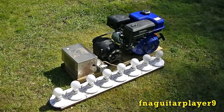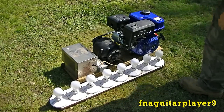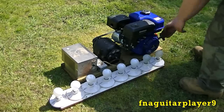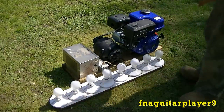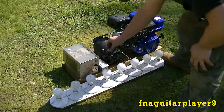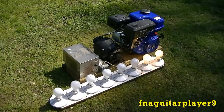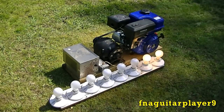Now I'm going to start it up under load, and you're going to see the bulb won't come on. I'm going to unplug it and try to hook it up and see if it will start. If not I'll rev it up and try it again. It didn't come on — remove the load — it didn't start. It started on the next turn. If it didn't start you'd have to rev it up, then put the load on after you rev it up.